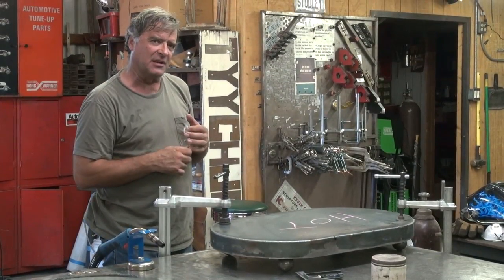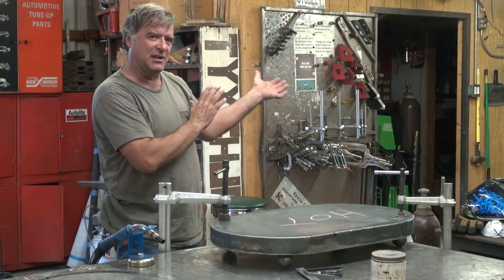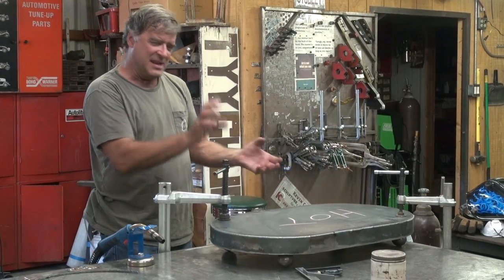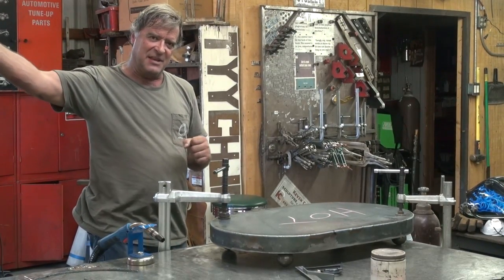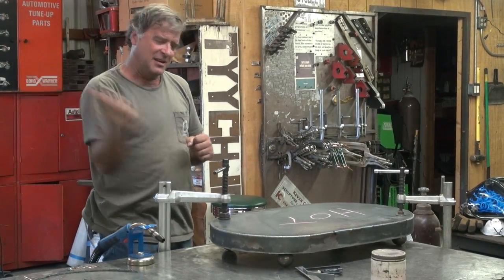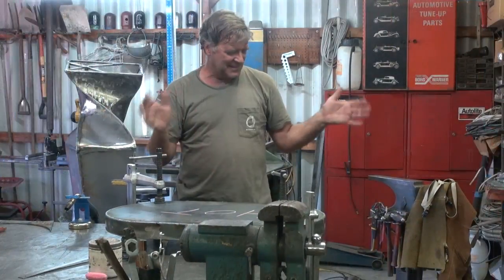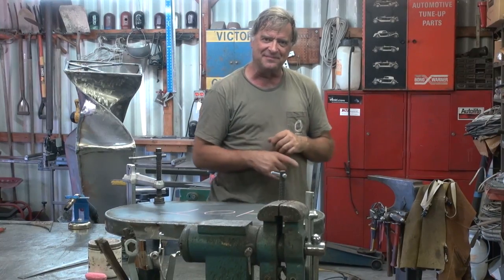Kind of an interesting little machine, really, with the MIG and the stick functions in there. You kind of get the best of both worlds without having a TIG machine. You can run that MIG and get all your medium thickness stuff, but once you want to get up over 3/8 of an inch or a half inch and into really heavy plate, you can just switch it over to stick. Right now over on Longevity's site, normally $2,500, and it's selling on sale for around $2,200-something. I think you'd find the machine has a lot of power inside there.